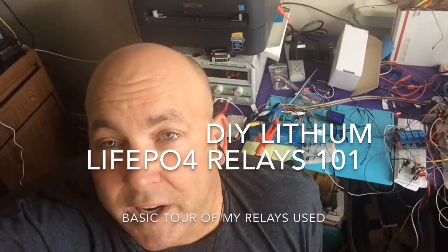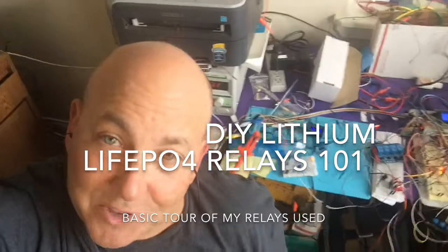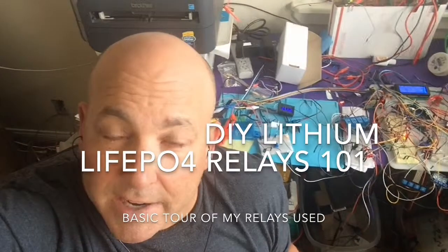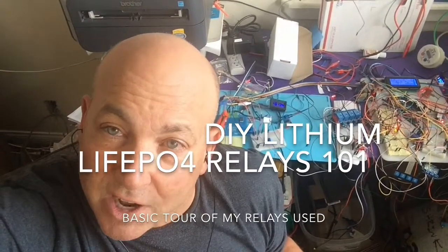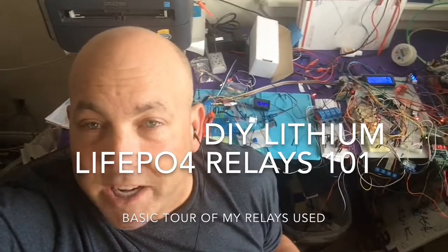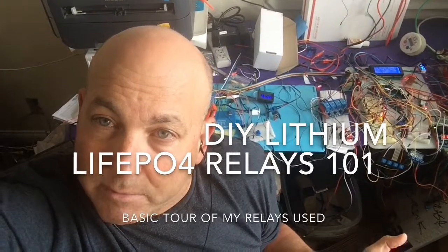So if you're going to do a project on your boat like I am for lithium, LiFePO4, the topic of relays is really important, where it's not usually that important in battery management. The problem with LiFePO4 batteries is once they get to a certain voltage, either lower or higher, you're going to have a problem. So you need to have relays take some action to shut things off because we want to stop the energy. So I'm going to go over some basic things that you might already know about relays and just show you the relays that are involved in the new battery management system.